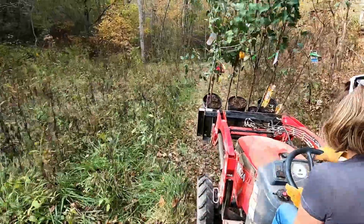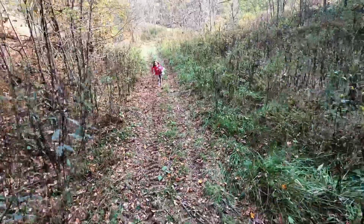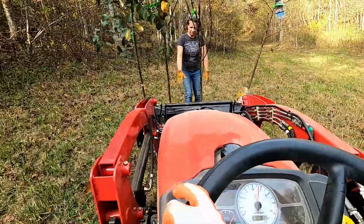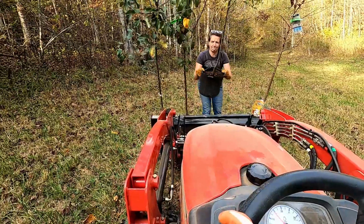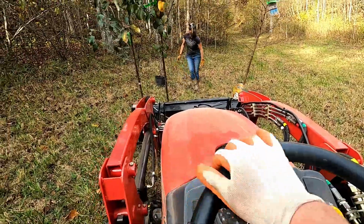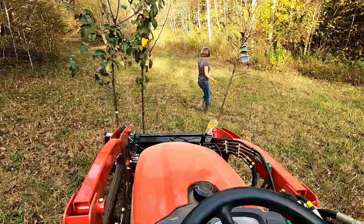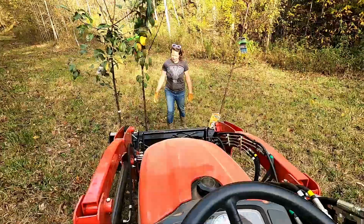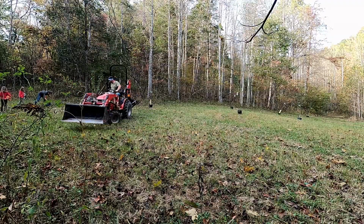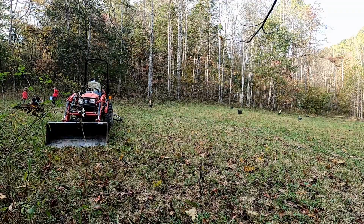Today is Wednesday, and we will be moving the RV here on Saturday. And we are going to finish with the septic, hooking it up. We also have to do ground ties. Our inspection is going to include checking out the ground ties. So we have to do 4 cement supports in the ground with ties to the RV in 4 spots. That needs to be done. We're gonna do that on Saturday, Sunday, and we're gonna hook up the rest of the septic.